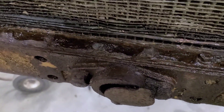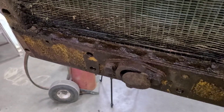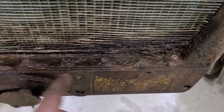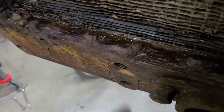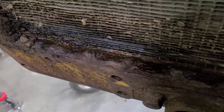I'm hoping that the core did not suffer any of the corrosion that has happened down here. But either way, it needs to come apart — I need these cast iron pieces even if we end up replacing the entire core. So the next step: I'm going to work from the bottom up on this, only because I'm holding it from the top with the forklift. I'm going to take a grinding wheel after all this brake clean evaporates and get rid of all these bolts. There's no way you're going to get on any of these — maybe that one, maybe — but it's not worth it. I'm just going to cut them off and worry about getting the rest out later.